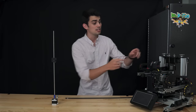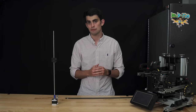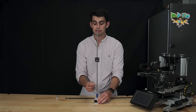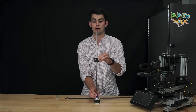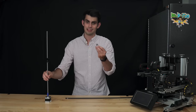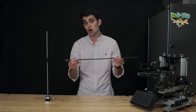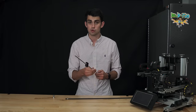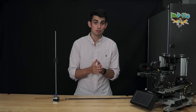So why does the Zydex use a lead screw driven transmission for its Z axis? To answer this, let's quickly discuss how this form of transmission works. Usually, a stepper motor is connected to a lead screw through a coupler. As the stepper motor spins the lead screw, a nut block will move up and down the lead screw. This is fairly analogous to the normal mechanism behind a nut and bolt. However, unlike a typical threaded rod found at your local hardware store, the lead screw has special threading to minimize backlash and allow for load transfers without jamming. This is fancy lingo for saying the lead screw can move objects smoothly and accurately.